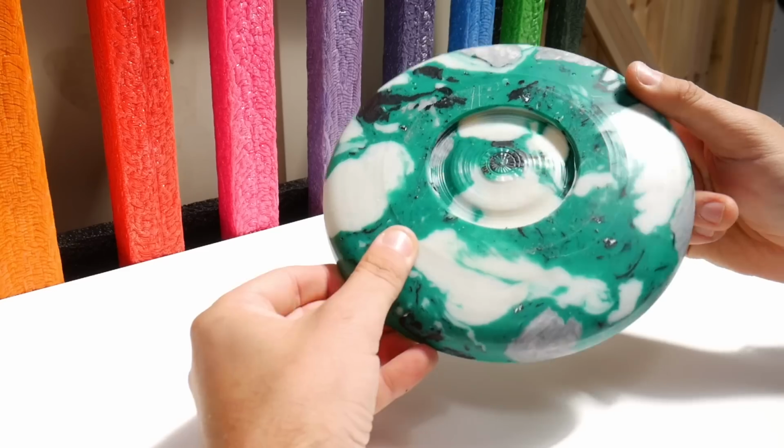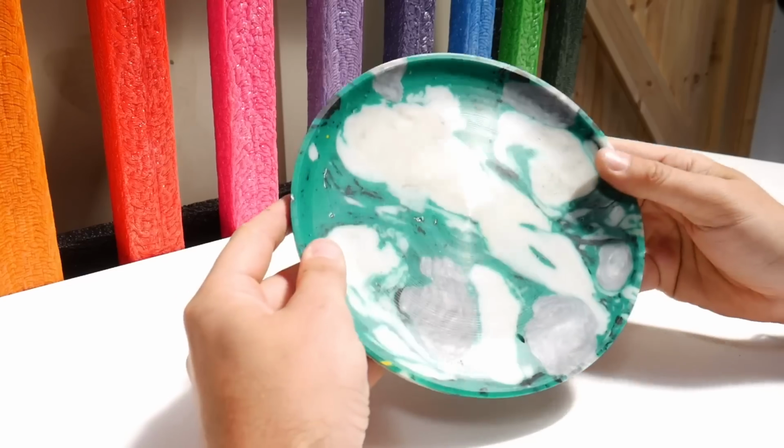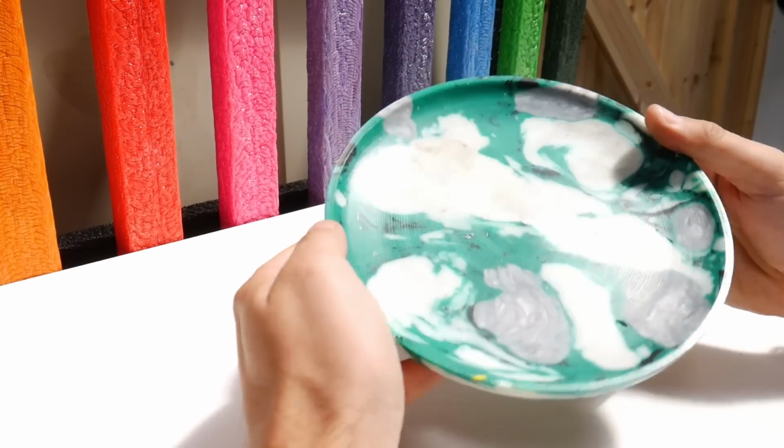Now, once the turning was finished, it did reveal a few spots of some slight discoloration. Now, interestingly, this only happened on the areas where we used the translucent milk bottles. And this is actually the main reason that we don't collect and use milk bottles in our product range. We always find that they discolour much easier than any other source of plastic that we use.